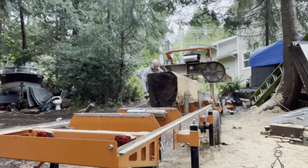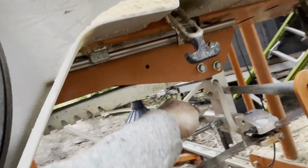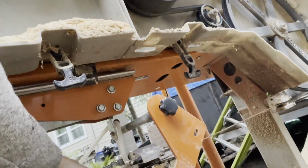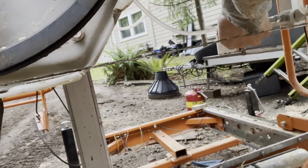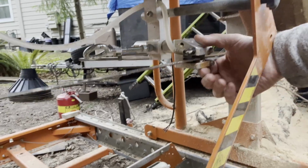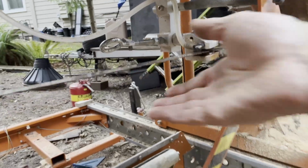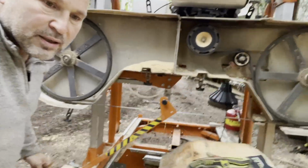That's probably what happened. The set screw had fallen out of the blade guide. This set screw had come out, so this was all floppy. So when I was pulling back on the mill, some weird tension, pulling it forward, caught this. This was all turned sideways, and that is possibly what snapped the blade when that got caught up in there.